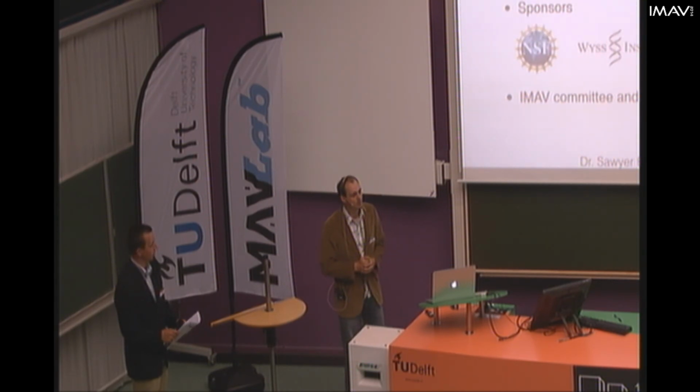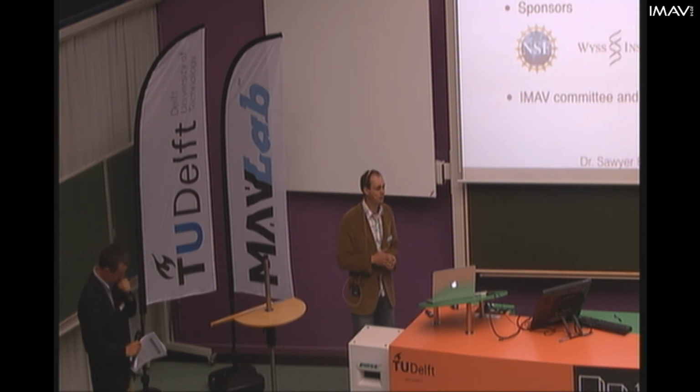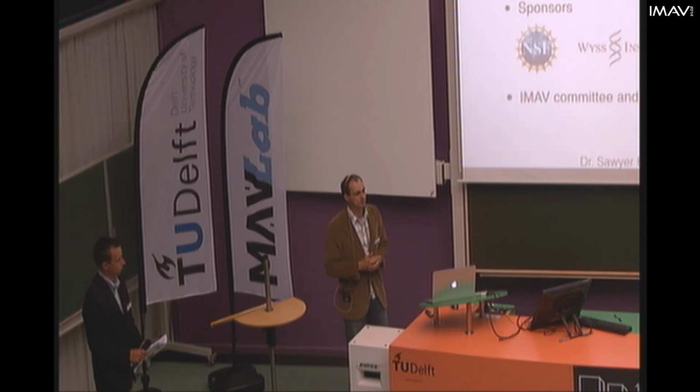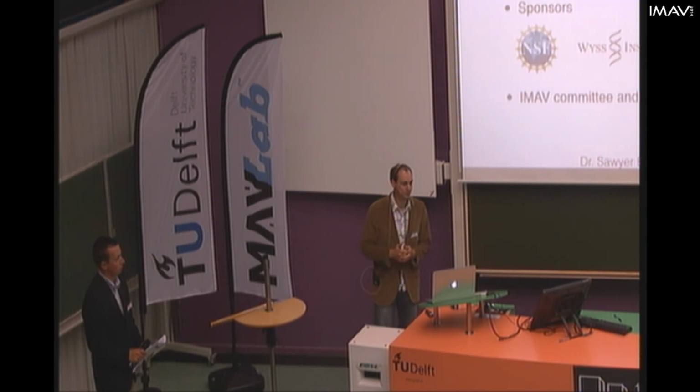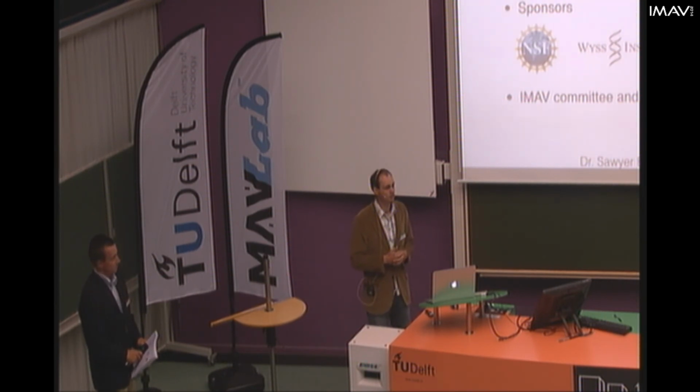So the question was, how's the filtering done? In our case, I think the sensor has the ability to do its own filtering. But we wanted as much flexibility and control, and with a desktop computer, we have almost infinite computation resources for these purposes. So we just do it on the desktop computer. And yes, it's a low-pass filter. More recently, I've switched to using a notch filter, which gives a little bit better performance and lower latency.